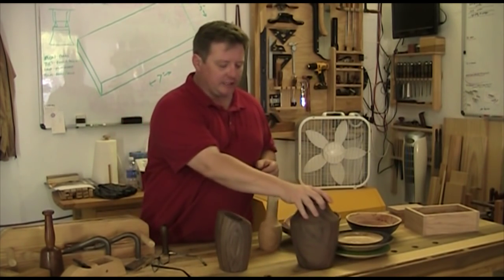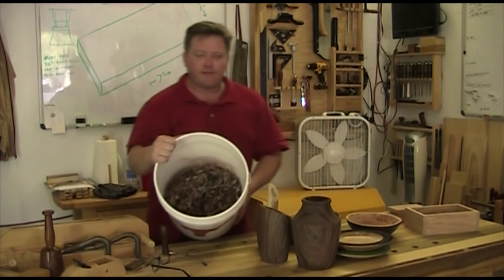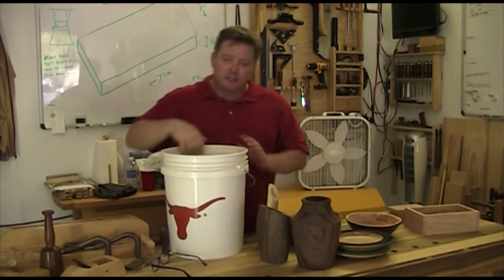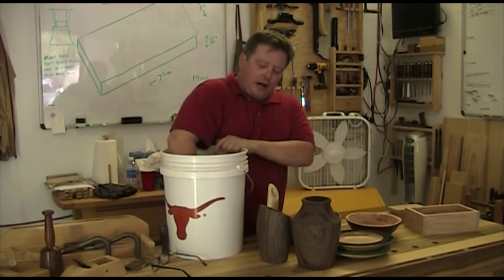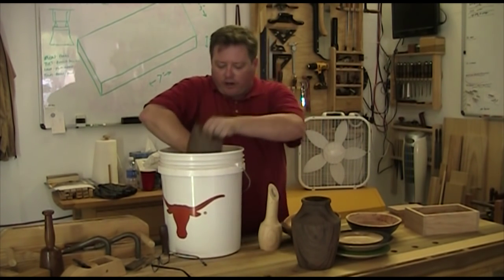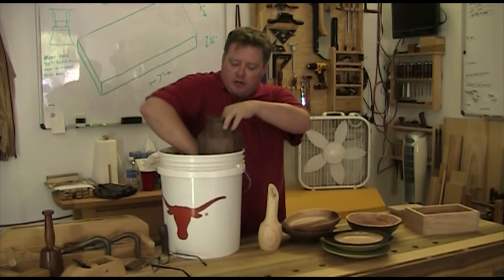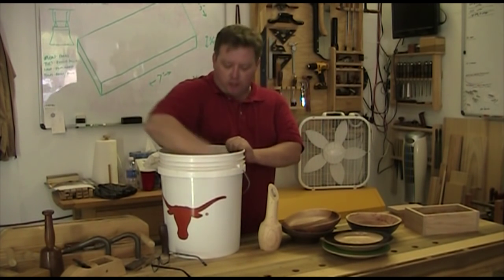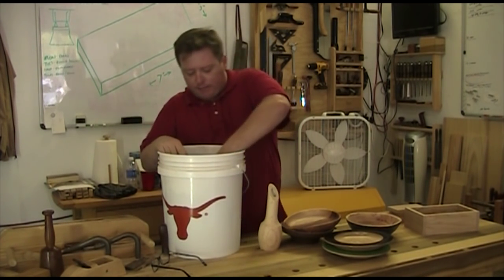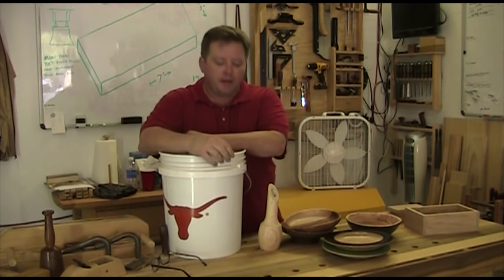This is one of the tricks I do in this kind of situation. I will take some of the shavings from that very same turning — because the shavings are also wet but there is a lot of air around them — and I will actually bury the wood turnings in the shavings in a little bucket. Every day I will come through and flip the shavings around. The shavings help slow down the drying process and prevent a little bit of warping and cracking.